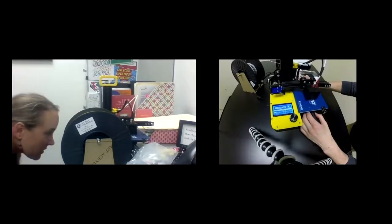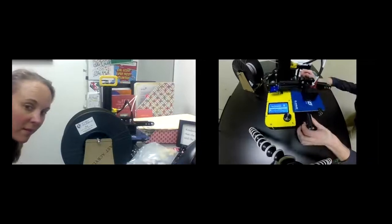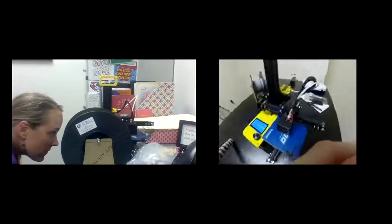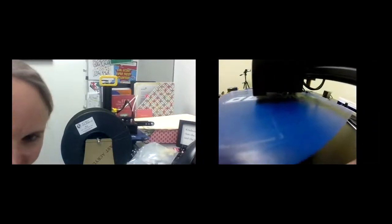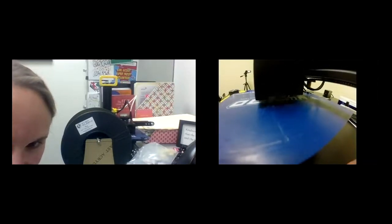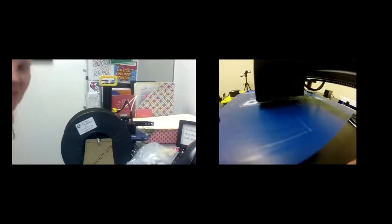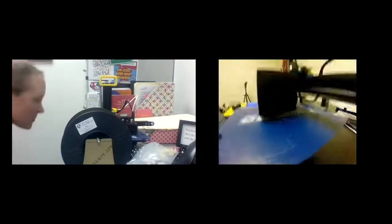I don't think it's working — it's touching the blue thing. So let me go to my side view. The plastic is there on mine but it's the same color as the build surface so it's hard to see. I need to get a different color for training. Depending on if it's too close, it won't print out the yellow at the very beginning. If it's too far away you'll see it, but it won't be sticking to the build area.